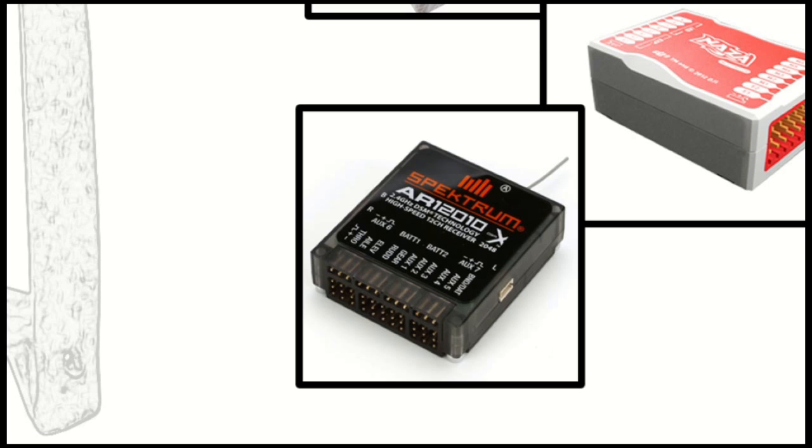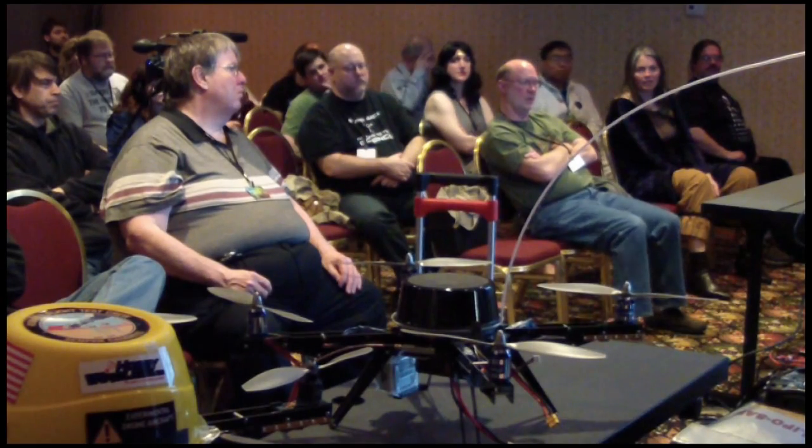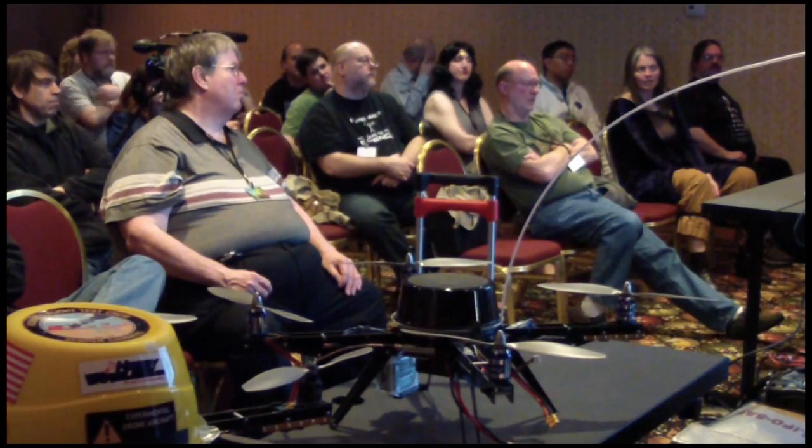As for the flight control system, you can either build your own. There are plenty of open source projects, like this software I have on this computer, this little guy is completely open source. There's one that uses parts from Nintendo Wii. You can take apart your nunchuck and get the accelerometer and gyroscopes out of that one. It flies very well. They don't work as nunchucks and Wiimotes after that though. So if you're willing to sacrifice some Nintendo components, you can get yourself flying pretty inexpensively.